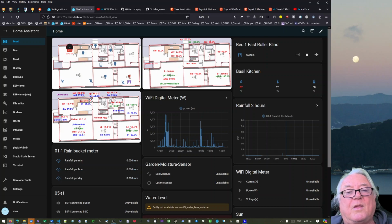So when we waved over the sensor, whoomph, you see it took a couple of milliseconds or bits of seconds to get there. So it sent that signal. Where has it sent that signal? Because it's paired with my device, it sent it up to the cloud, and then it says that's activated. So it's come down, and then it's saying, oh, that state has changed from clear to detected. So it's changed from 0 to 1. And then it's gone into the automation. The automation says, oh, when that goes into a 1, you need to go and work on the bulb.